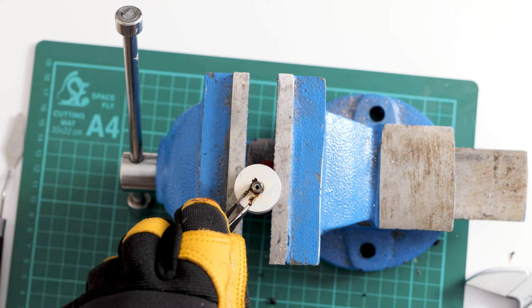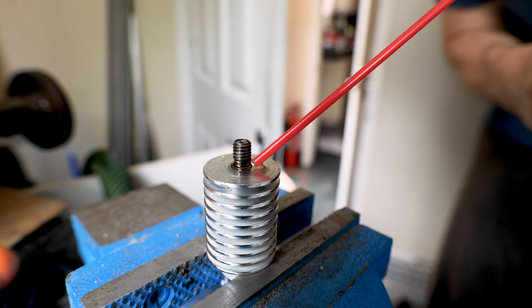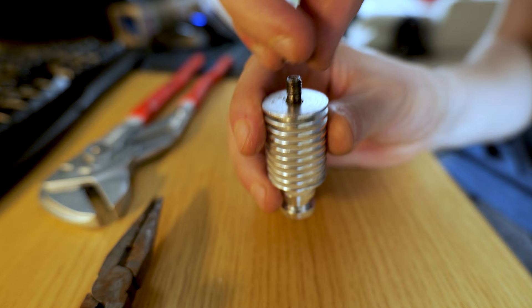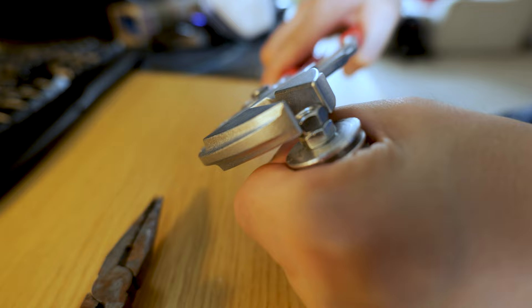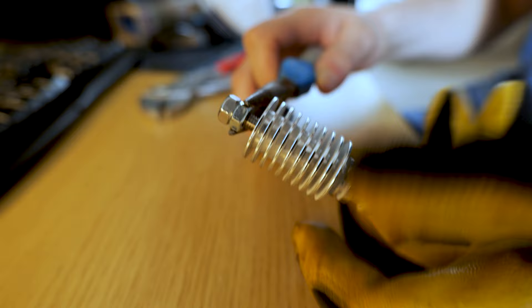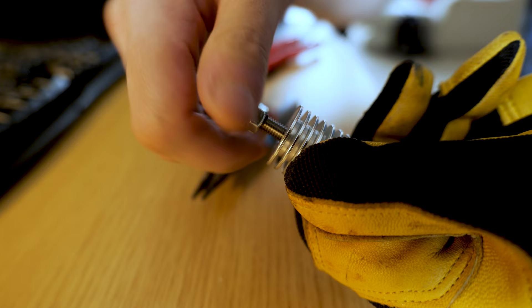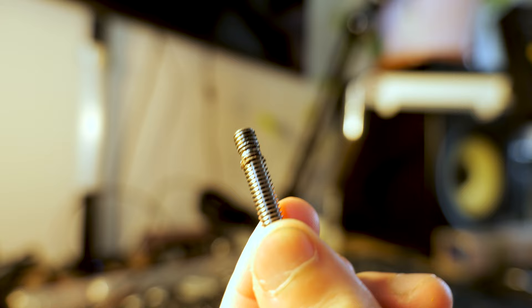The heat break was well and truly jammed in the heat sink and all parts being cylindrical you really have nothing to grip onto when you try to remove these parts. This WD-40 method worked great - put a little bit of WD-40 and let it work its way into the threads of the heat sink, then place two M6 nuts on the heat break. You tighten down the top nut and then twist the bottom nut against the top one to leverage the thread out. This is a great way to remove threads from anything if you can't access a cap or a head of the screw. This looks easy in a video but trust me I had to really bear down on this nut to get it off - I was literally wrenching it between my legs to get this thing off. You can see the melted plastic has worked its way into the threads, so now it's time to clean this heat break.